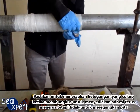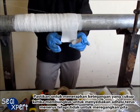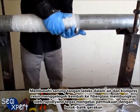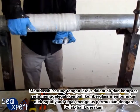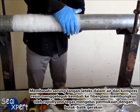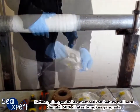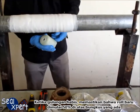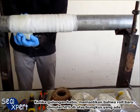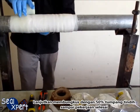Make sure to apply sufficient tension when wrapping to provide continuous adhesion but not to stretch the tape. Wet the latex glove in water and compress the bubbling resin back into the fiberglass wrap by rapidly and firmly stroking the surface with a back and forth motion. When the roll runs out, ensure that the new roll starts out 50% on top of the existing wrap. Continue wrapping with 50% overlap until the job is completed.